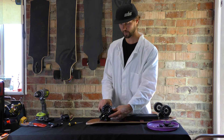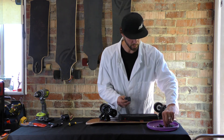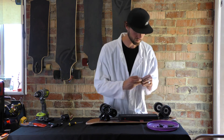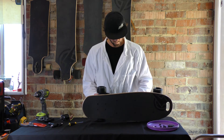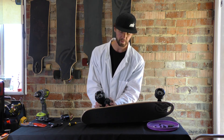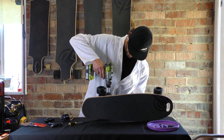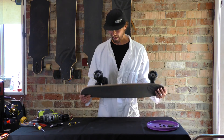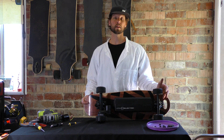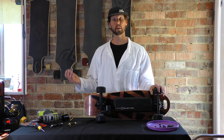The last step of this process is to put your pulley cover back on. What I do is drop my screws into the holes first - that helps me locate the holes as I put it on there. Then I go and drop them in until they seat. You'll see all those guys are lined up, and the outside will be nice and flush. If there's a big gap, things aren't lined up quite right. Once you have that, give these guys a good tighten. And there you have it - that is a motor replacement on a B-series board. If you've got any questions, feel free to leave them in the comments section below. We're always happy to get your feedback. Hit the subscribe button to stay up to date with future Tech Talks with me, R&D Lee.